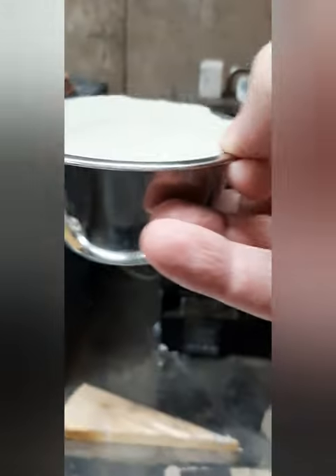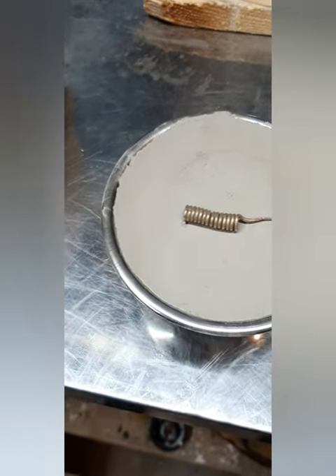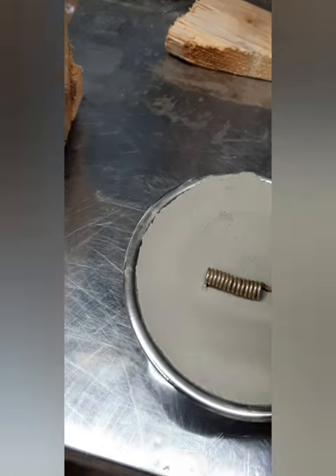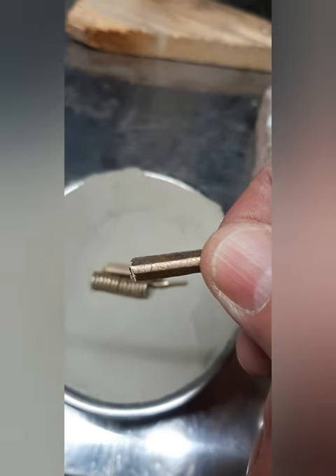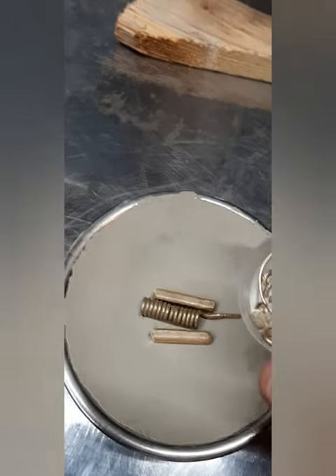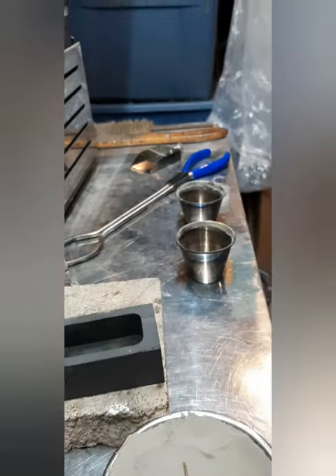Okay, here we go. This is just a little steel but it's got Portland cement in it. I'm going to refine this gold here — it's got solder and all kinds of crap in it, whatever's cadmium, zinc, who knows, whatever that makes it crack. When I'm working it there's some cracks there, and it's just useless. So I'll put it in this pot with some Portland cement and see if I can set this thing up.